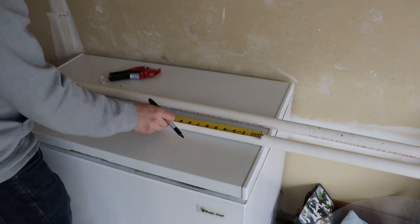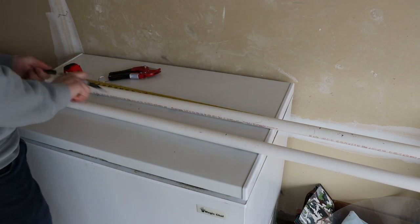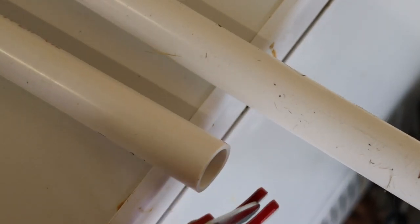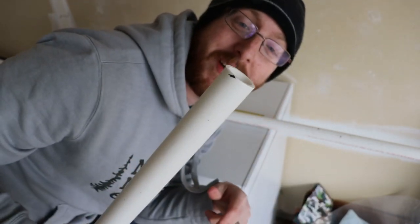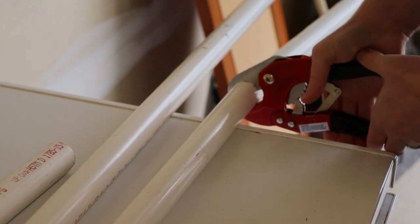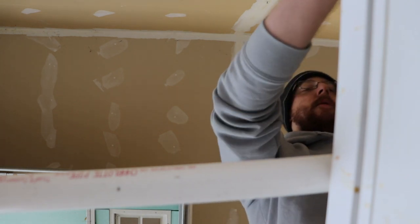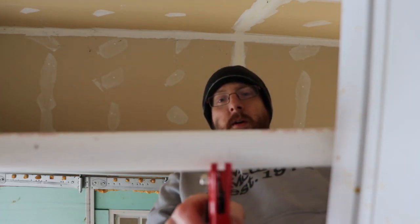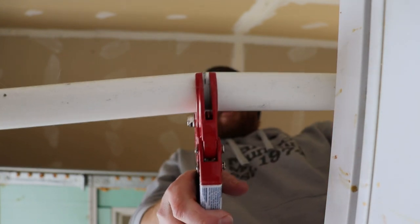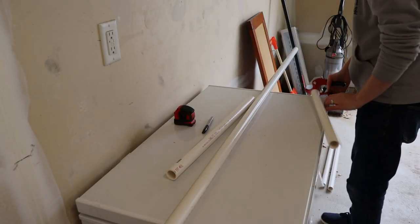So there's 24 — another 24, and another 24. There we go, nice clean cut. What's nice about using these PVC pipe cutters is they don't make a mess. You could use a hacksaw for this or some other kind of electrical saw, but you'd be making a big mess spitting PVC pipe everywhere — that's just really nasty, really bad to breathe in. The downside is if you had to cut any more PVC than this, you'd probably want electrical or mechanical advantage, because it just takes a lot of work. On the plus side, it's a great grip workout.